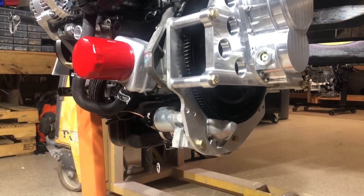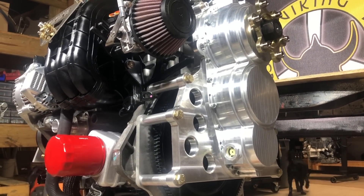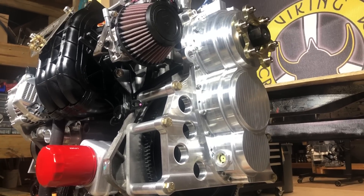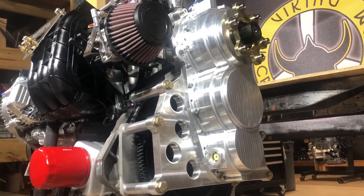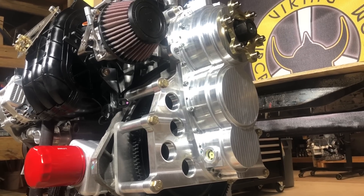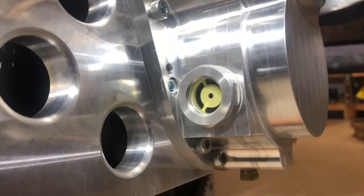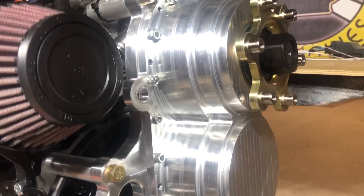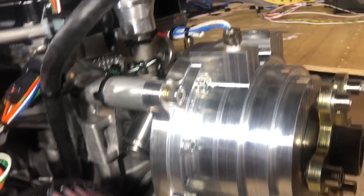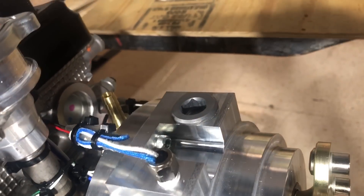Looking at the front of the engine, the reduction drive comes in two different varieties. For the 90 horsepower, we have a three-gear gearbox, which turns clockwise seen from the cockpit — the same direction as the popular Rotax 912 and 914 engines. It has a sight glass built-in, making it very easy on a pre-flight to see how much gear oil is in the gearbox. It also has a temperature probe that measures the temperature of the unit and a large fill port for the gear oil, as well as a drain plug on the bottom.